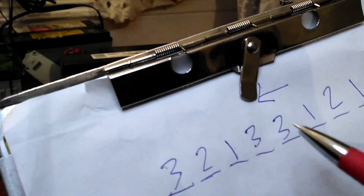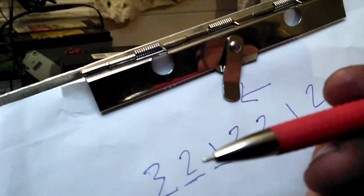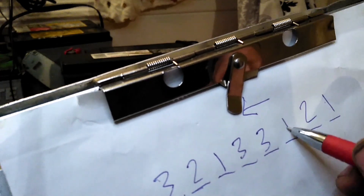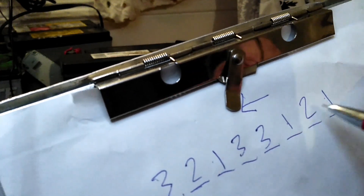So what I like to do — I've already decoded this — but I like to draw a picture with a little arrow to know which way the tip of the key is, so I don't get it backwards. And then since we know the 1st, 3rd, and 6th wafer is a 1 cut, I'm just going to mark those with a 1.